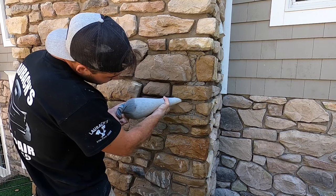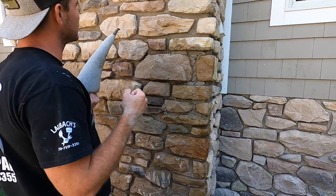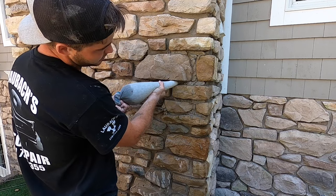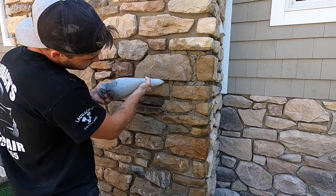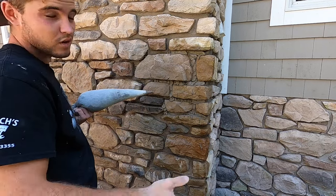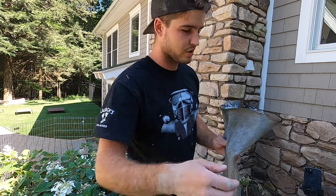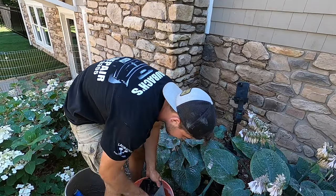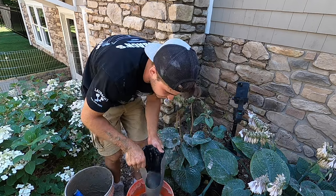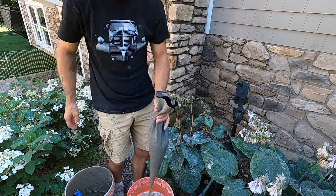Just keep doing that, making sure you're filling in. The biggest thing when doing this is you want to make sure these joints are completely packed in there — I always shove the nozzle all the way in and let the mud squish out so they are full. I usually do half a bucket at a time so I don't get too far ahead and have the mud start setting up. In between filling bags, keep the bag wet and clean or the mud will get stuck. Just wash it out a little bit between fillings — make sure the stuff runs through and you're good.